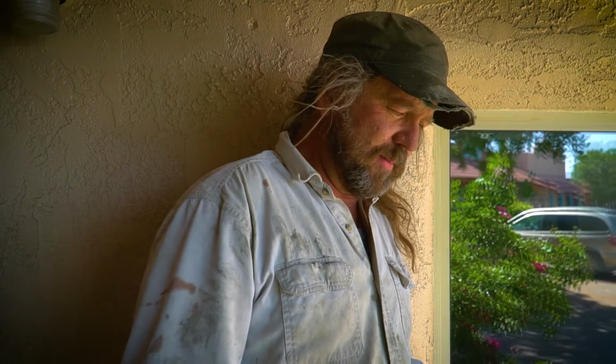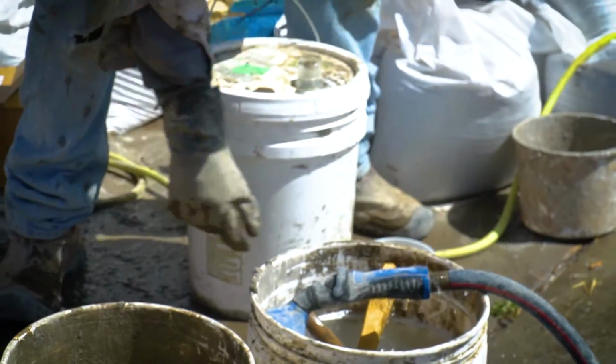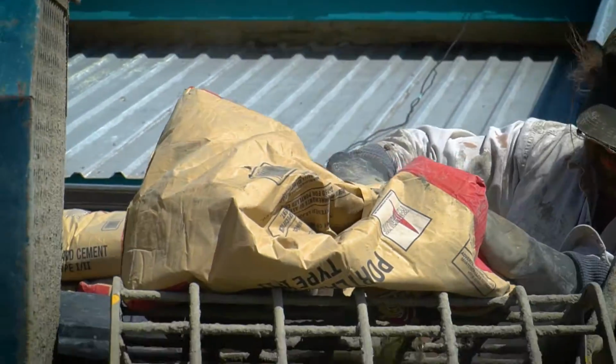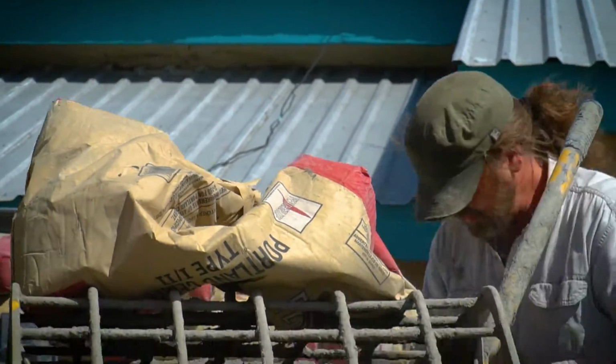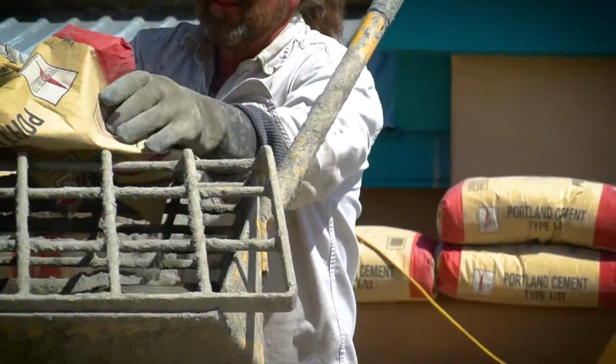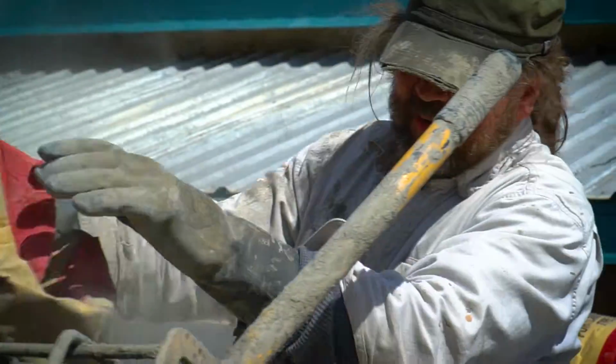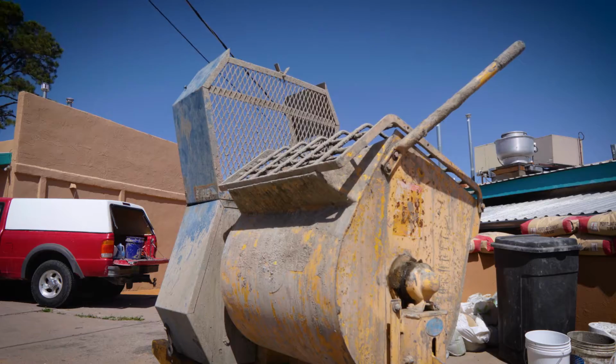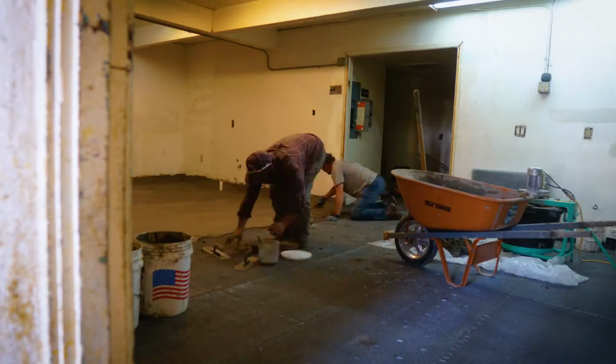Yeah, so the mix is a little different than cement or concrete in that it's an ultra low water mix, and it's also a reactive powder mix. So the silica fume and the refined pozzolan fly ash reacts with the CO2 in the atmosphere and continues to make crystals forever, and so it continually gets stronger.